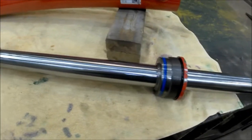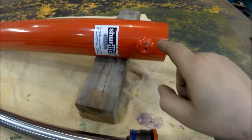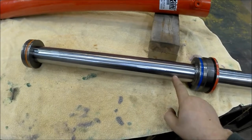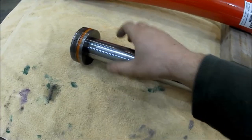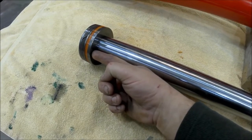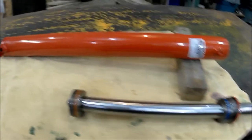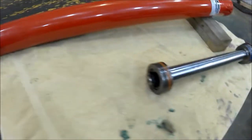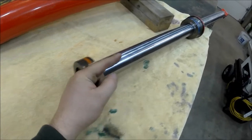When you put hydraulic oil into this port, it flows on this side of the piston, fills up the cavity with oil, and puts pressure on the piston pushing it that way — meaning it will retract the rod. Then if you switch it around and put oil pressure into the other inlet port, it puts pressure on this side.